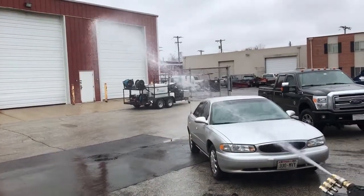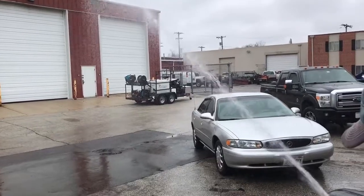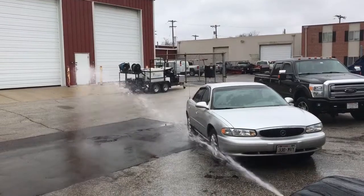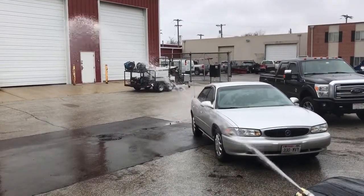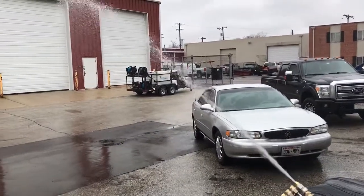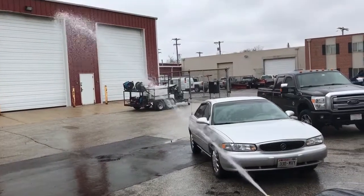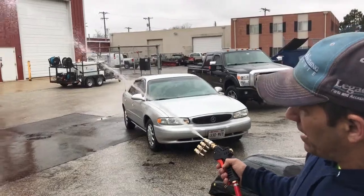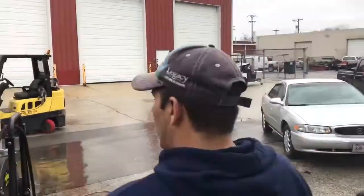I'm going to hit the A button to draw through the proportioner. If you come around the side here you can get an idea — this is shooting with the booster pump right now and I'm getting about — it's pretty windy so it's kind of atomizing it quite a bit, but I'm getting a pretty good distance. If I go with a larger nozzle — right now I'm running a 40 nozzle, but if I go up to a 60 nozzle I can shoot a lot farther. So I'm going to switch to the proportioner, and you're going to see we're running through the proportioner right now. There's really not much change; if anything we're getting a little more distance because we're not at quite as high a pressure. It's a little more stabilized, we're shooting about the same distance — about 35 to 40 feet.